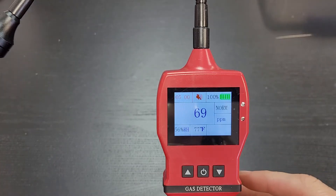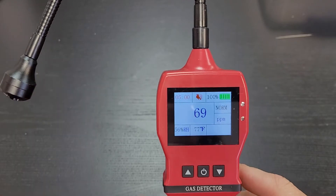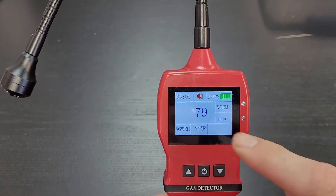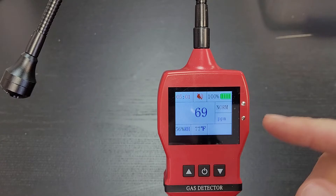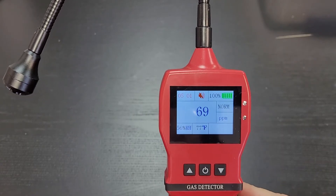Welcome to our 90E red gas leak detector calibration. This is the device — we just turned it on and we see a residual amount. I get many emails asking why it's not zero. Anything less than 300 or 400 is very normal.